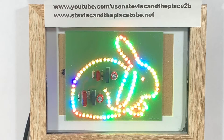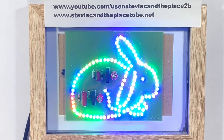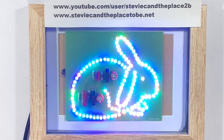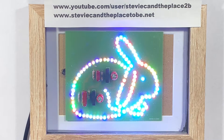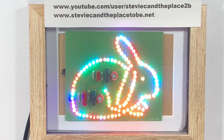So this is hopefully a quick update to the Jojoba Bunny LED PCB project. A few months ago I designed and manufactured an LED PCB based on my sister's bunny, Jojoba, who is now a rabbit, but he's still a bunny to me. It was a mains-powered luminaire featuring two strings of LEDs forming the outline of the bunny, driven by capacitive droppers. It could be installed into a picture frame or a reused LED floodlight case, the obvious disadvantage being the mains power not being ideal for outdoor use or areas around prying fingers.